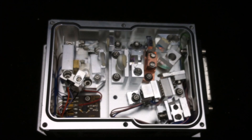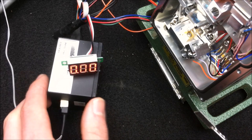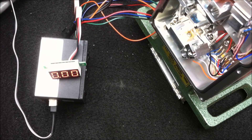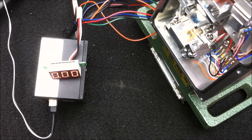Let's do some pump diode tests. The first test will check the optical output from the pump diode itself — I'll use this little mirror to reflect the pump diode light into my laser power meter, so we can get an idea of how much optical energy is coming off the pump diode. Then we'll do an electrical test. From what I've seen on a functioning laser, there's about 1.1 amps for every 1 optical watt out on the 808 nanometer pump diodes, so we'll be able to check optical output power versus input current and get a rough idea of the difference.